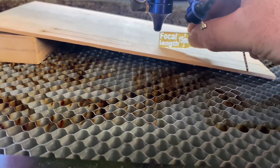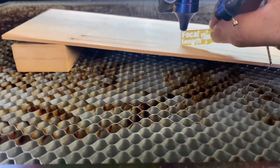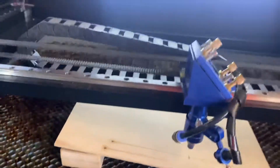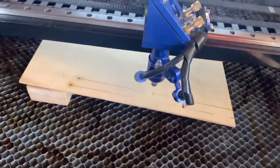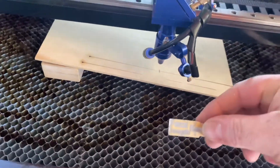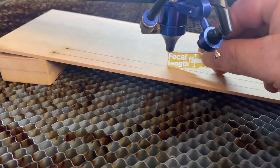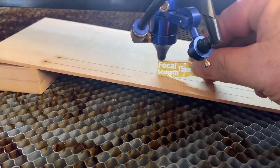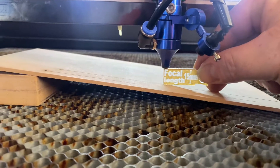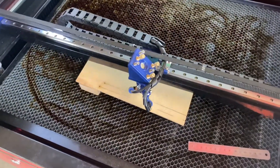Pop that under there and make sure it touches the bottom of the nozzle and the top of the material — and it does, so that's good. You can also use a ruler or a set of calipers to measure that distance, as long as you don't move the laser head front to back. As I said, I just use this little tab provided with the laser machine. You want it touching the surface of the material and the underside of the laser tube — that gives you your exact focal point. Thanks for watching.